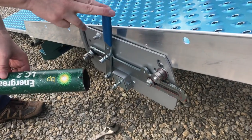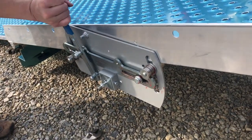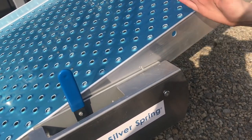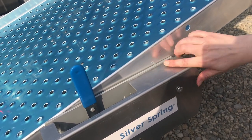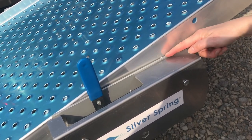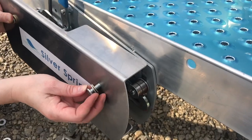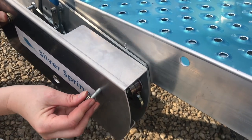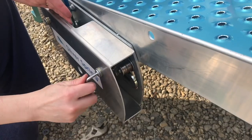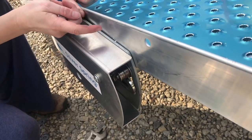In order to get this tilt lever to work we had to put grease on all these mechanisms around here — without the grease we could barely move this. If these bolts have been tightened too much you will not be able to tilt the bed downward because the bolt might actually dig into the side frame. Be sure when tightening these bolts you're not going beyond the back plate. We're backing these bolts out so they don't tighten against the tilt bed. We ended up adding a couple of washers behind this bolt because it was digging into the tilt bed and we couldn't tilt it down. Tighten these bolts only as tight as what keeps it from rattling and does not dig into the bed, then tighten the lock nuts.